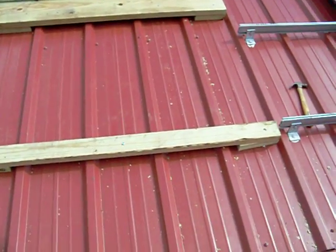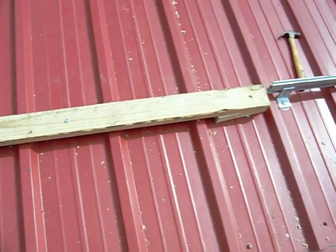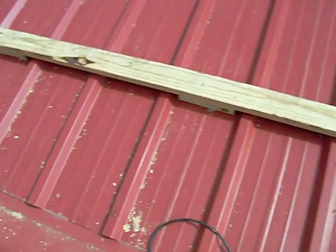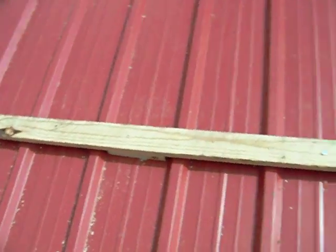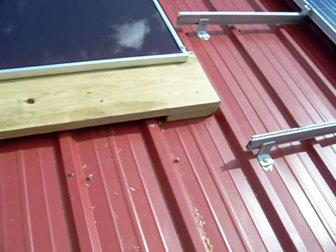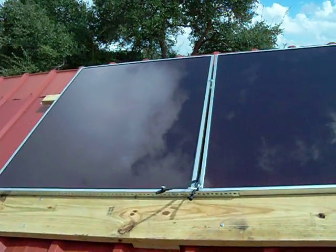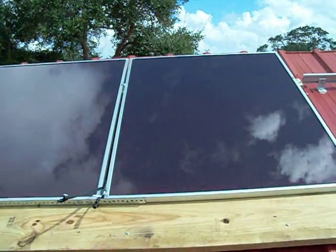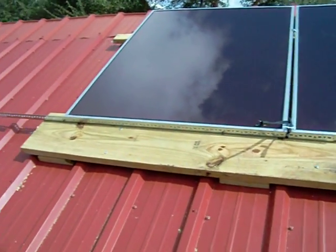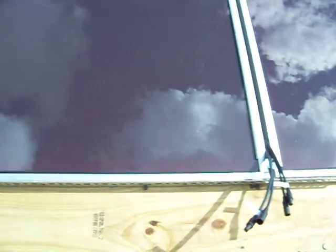After I built my two-by-fours and the two-by-twelve and screwed them down with the five-inch lag screws, I just went straight down into the roof. I put four lag screws for each one — two over there, one here, one here, and one over here. The two-by-twelve has a couple more, and the same thing for the top one, which has four screws in the two-by-four.